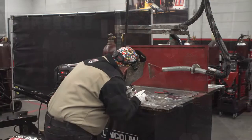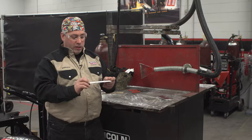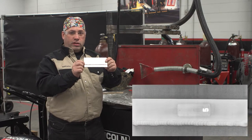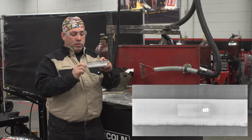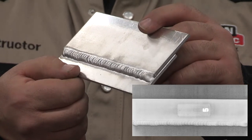We're going to talk about TIG welding now. Gas flow rate — 15 to 25 should be pretty good. And amperage, I've got about 140 amps on my machine. I'm also going to be running the eighth inch 4043 filler material. As you can see again, I got the start here and the end of the crater here, and in between, with proper cleaning, I don't have any porosity in my weld.